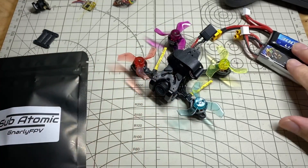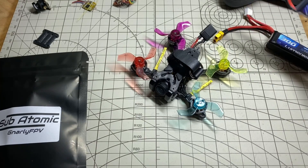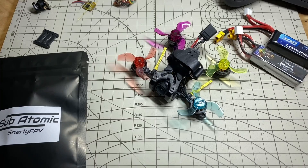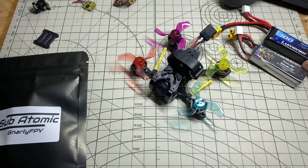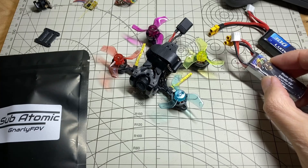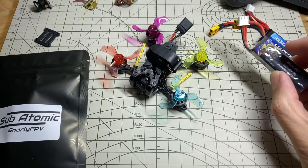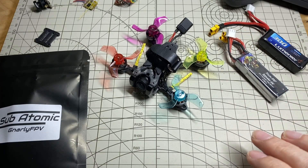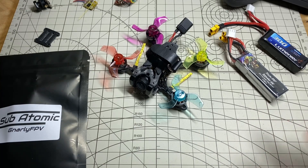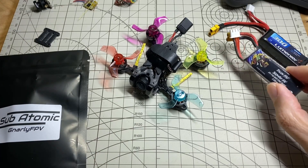I addressed the video issue, and the next thing to try was high voltage batteries of the same capacity as non-high voltage. Sure enough, I got about 30 more seconds out of the high voltage Talon battery — about three minutes, which I think is a good minimum flight time, versus two and a half minutes on the normal voltage 2S 300. So the high voltage is definitely the way to go. You could say maybe these batteries don't last quite as long if you consistently charge them to high voltage, but I haven't had much experience with that being the case, and these batteries are only $6. I also haven't done JESC or 48kHz on this yet, but I could do that and probably add maybe another 10 to 30 seconds of flight time.